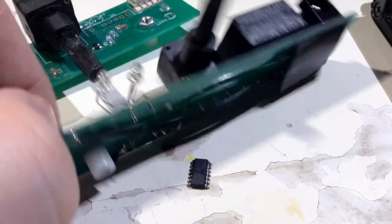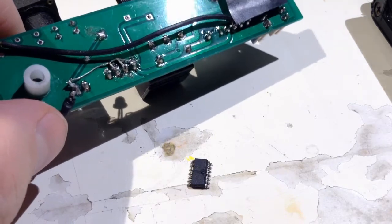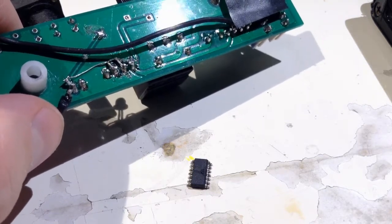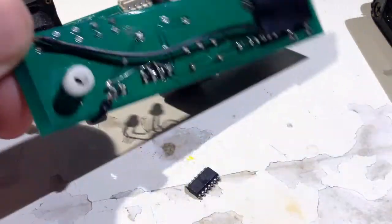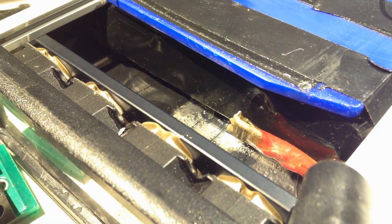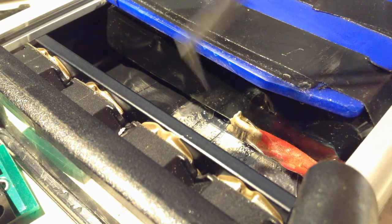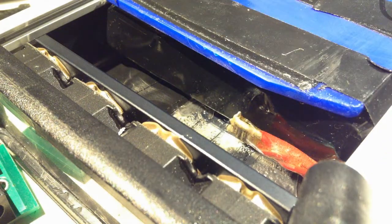But then I found out later, I think, that we had some problems with missing pull-ups or something here, because this connector here is going to, you see that little bugger there, I can show you in a picture. This guy is actually a chip with two thresholds. It's a thermostat, actually. So it has two trip points.